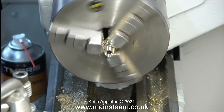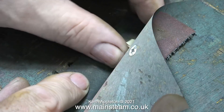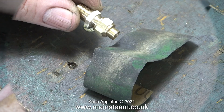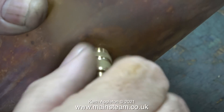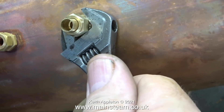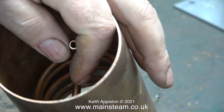Now it's time to remove any marks that may have been made in the brass by the chuck jaws. I'm leaving the union nut in place just as a guide so you get a really nice flat finish. First I used some medium emery cloth and then went over to wet or dry sandpaper — 400 grade. The fitting doesn't need to be polished; it looks okay as it is because when it's fitted to the condenser it's all going to be painted anyway. Here I'm screwing the part in position and tightening it up with my Bahco spanner.